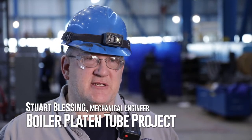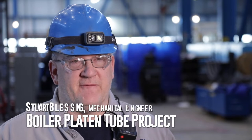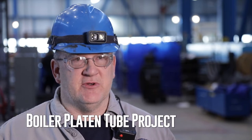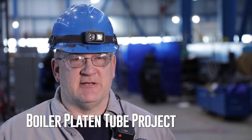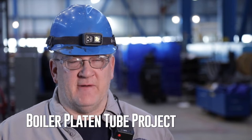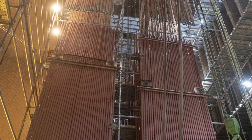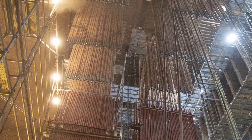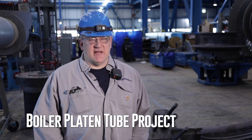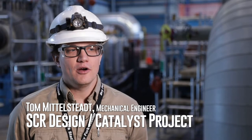We've had quite a few forced outages on our platens. The way they were originally designed, there's a lot of tube hanging out in the furnace gas pass flow, which causes a lot of erosion due to flue gas carrying ash up through it and damage from fly ash. To fix and prevent that in the future, we're replacing about the bottom 30 feet of the platen pendants. We've compacted them into a more flat design so there's nothing hanging out into the gas stream. Currently about six of them are up in place, all the old ones are cut out — there's a total of 18, so we're about a third of the way done.